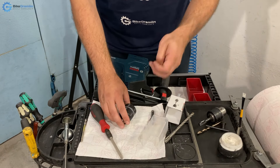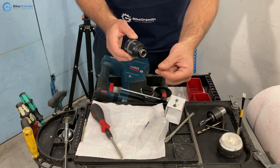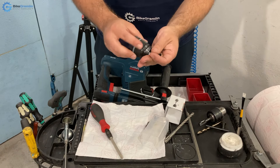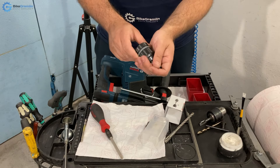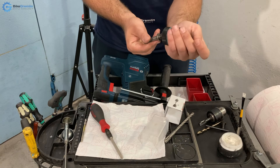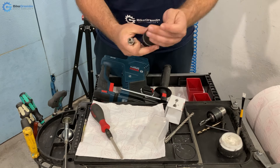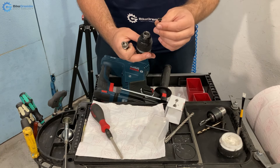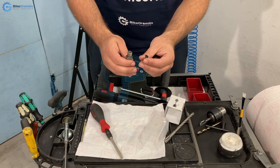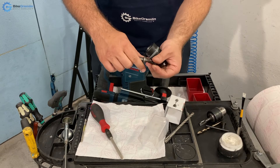Why is this a good design? When the drill is trying to turn this and you have a drill bit here, the drill bit will exert torque in the opposite direction on this holder. It will try to unscrew it, so when this is threaded in and the drill bit tries to turn counterclockwise, it is self-tightening in that direction. However, the reverse-thread piece goes the opposite direction, so if you do any twisting in the counter direction, that one will in fact tighten against the other — they are securing each other.